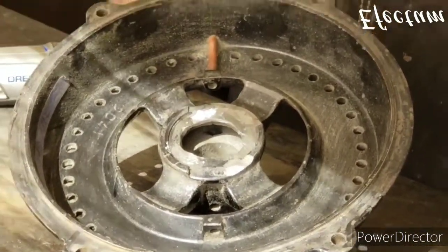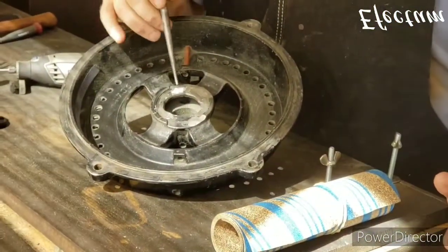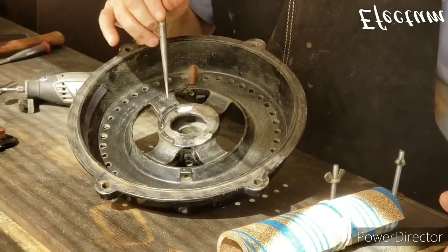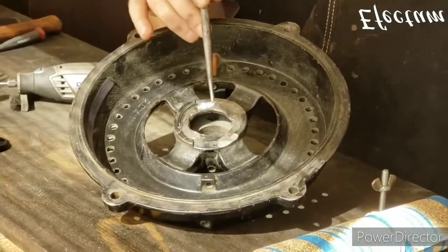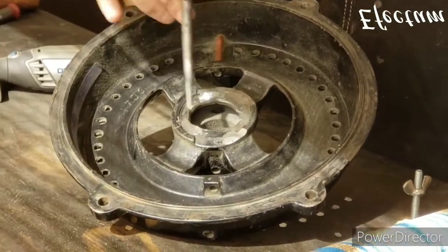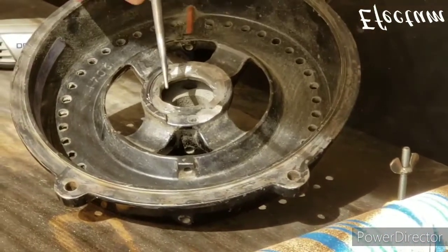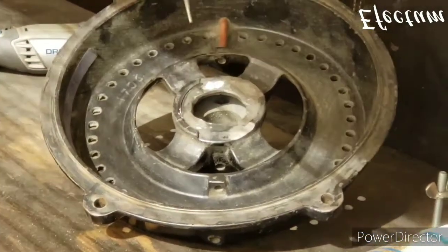And also I'm going to use some gasket material, and we will cut a new gasket for this area here so that it'll seal up any oil from dribbling out. The other thing that I'll do before I install the gasket is clean this area up, and I'll probably repaint just this area right here, just for cosmetics, to give it a neater appearance.